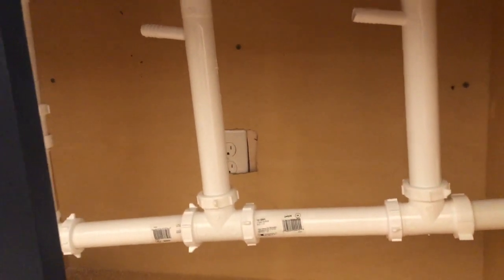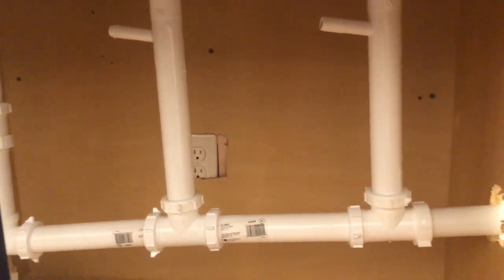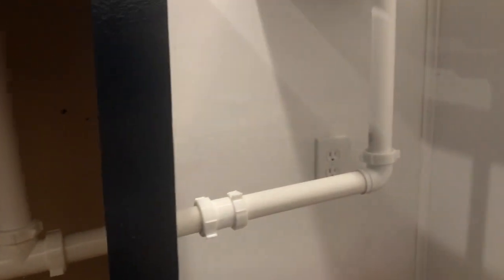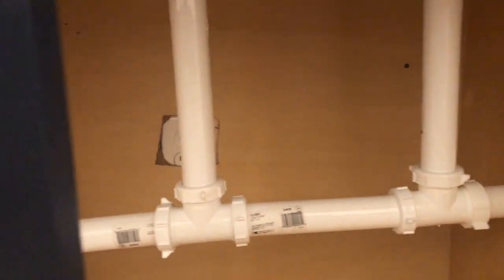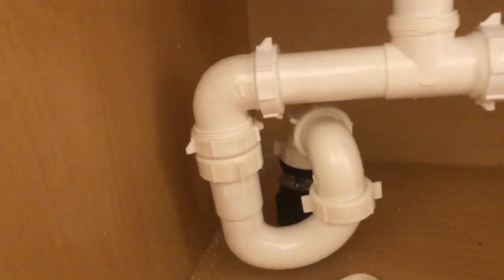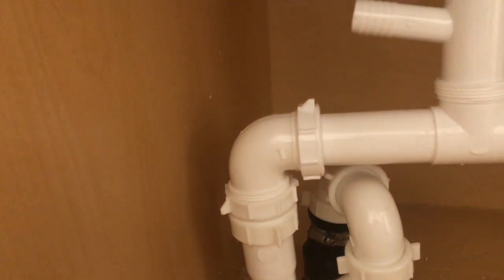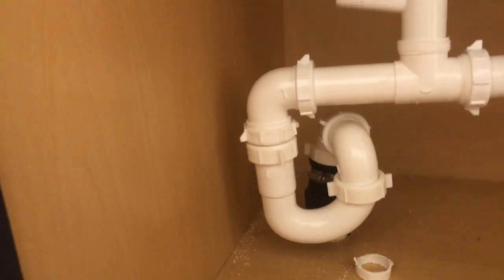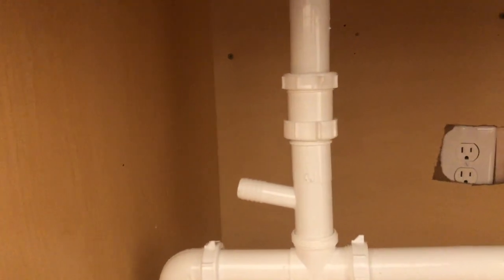There were a couple of leaks, just because I don't have any compound in it right now — which is fine. I went outside to the gray water tank and it was coming out nicely. You can see here the hand-washing sink goes down and angles so it can flow all the way down; the three-compartment sinks then go all the way down into the gray water tank, which is just below this coupler. I have that black flexible coupler going into the kitchen drains.